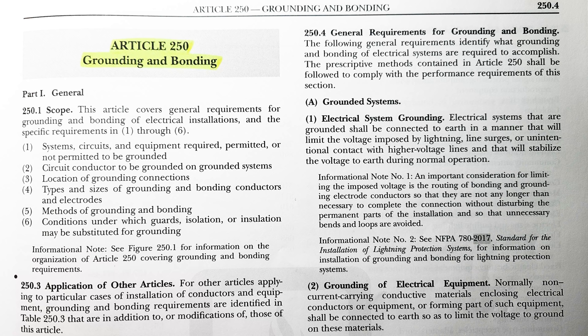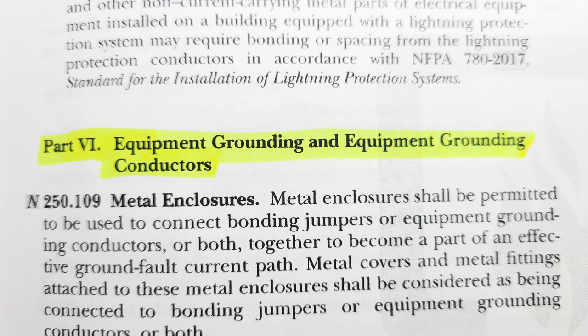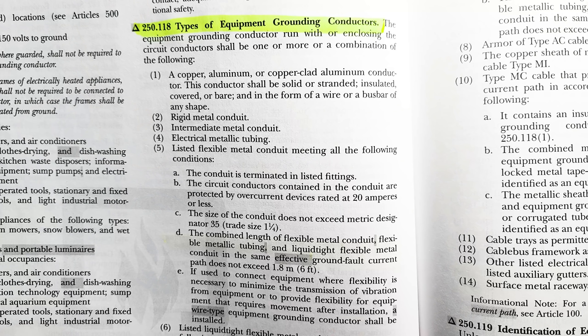Now, that's actually an approved wiring method. What the original installers did was use the conduit — EMT (electrical metallic tubing) — running straight from the panel to each air handler, and rigid metal conduit for the compressors outside, using that conduit as the equipment ground. Can you do that? If you open up NEC Article 250, Part VI — that's where grounding and bonding is covered — specifically 250.118, Types of Equipment Grounding Conductors, it says the EGC run with or enclosing the circuit conductors can be a copper or aluminum conductor, or it can be rigid metal conduit, intermediate metal conduit, or electrical metallic tubing — among 14 listed options.